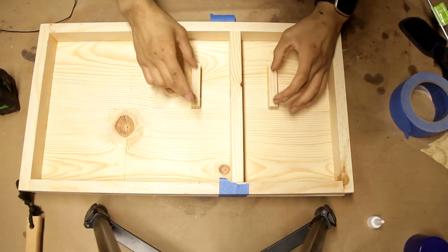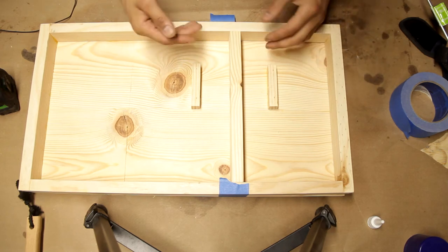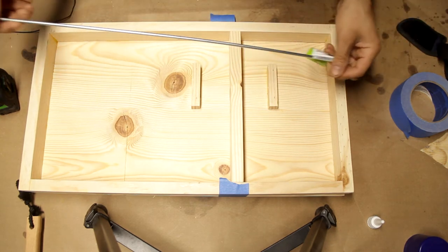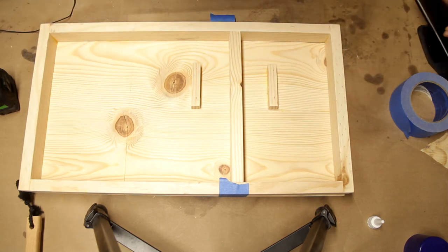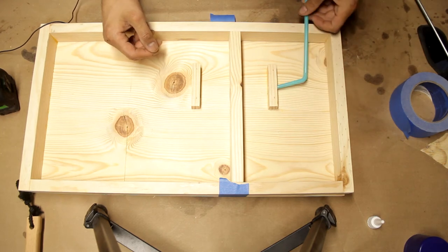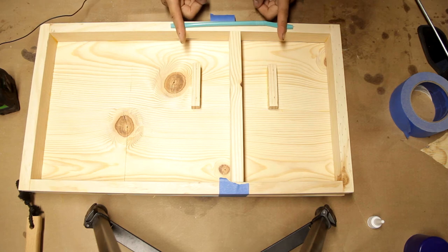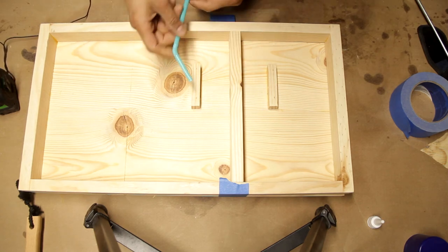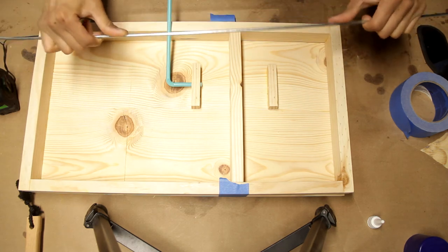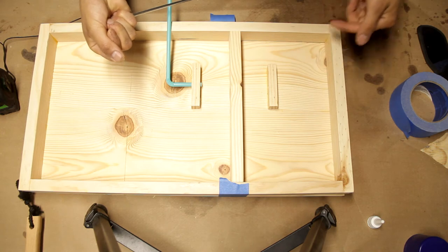We have these blocks fastened into place with a couple of brad nails to really hold them down. To make this laptop desk adjustable, we need something that's going to fall into these half circles to prop it up. I'm using a 3/16-inch round bar and we have to bend it — I'll grab a straw to demonstrate. We're going to bend it so that it hooks into either side of these blocks, then it'll bend up towards the top or far side of the desk, lay across on the bottom, and connect on the other side. I'll mortise out a good chunk so everything can rest flush. I don't really work with metal, but this is super lightweight and pretty bendy, so I'm going to put it in my vise, clamp it down, and tweak it to 90 degrees. I'll have to do that four times.